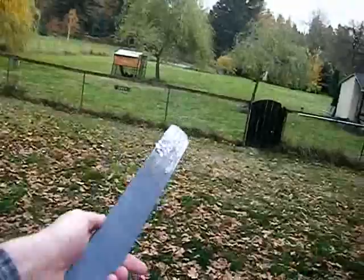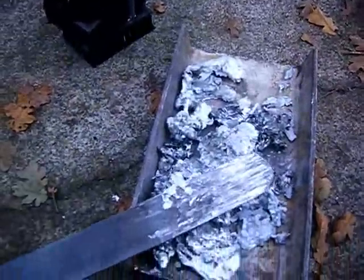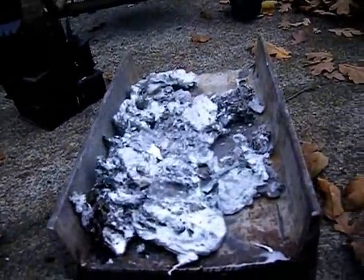This is dross. It's the junk we scrape off the top. I've got this scraper here — it's a 3/16ths bar of steel with a rounded end. I scrape the inside of the crucible, then use this steel I-beam to scrape off the excess, and there it lays.